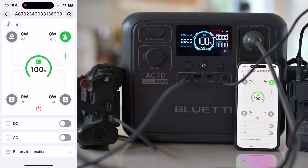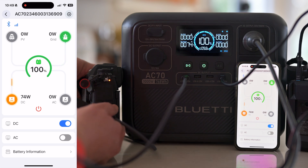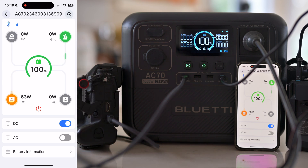So what we're doing here is starting with the battery being charged from the wall socket. Now what we're going to do is turn on the USB charging - we have a V-mount battery connected along with the Z9. The Z9's just come online and also the V-mount battery. The Z9 only takes about 15 watts and the V-mount goes a lot harder, so we're up at 74 watts. If we remove the Z9, you'll see that drops by about 15 watts - which there it has. We'll plug the Z9 back in and it will start charging again and equalize itself out.